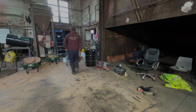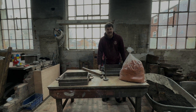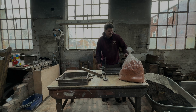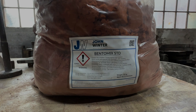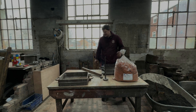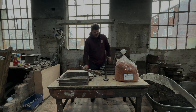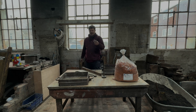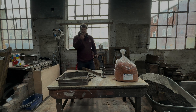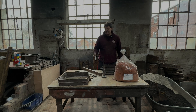For green sand moulding we have a tray of goodies: a box, another box, a tray, an extra table, and stuff called Bentamix — a really nice fine oil sand that feels really nice in your hands. Also a stick, a peg rammer, a flat rammer, a moulding trowel, and a vent wire. We'll need a parting powder bag — my glamorous assistant has just set off to go and get it.